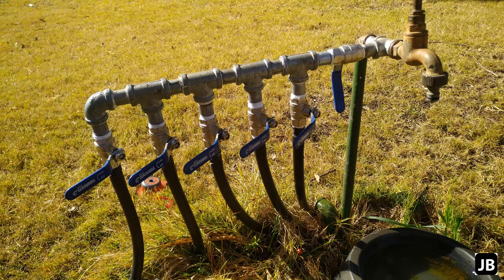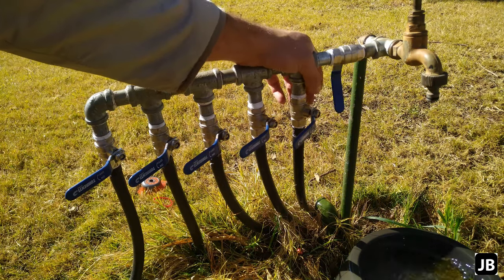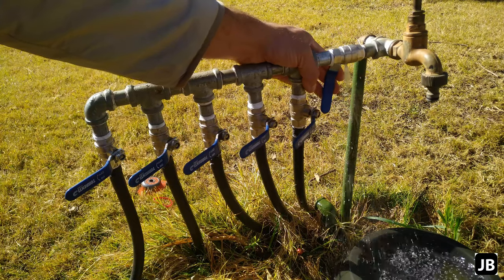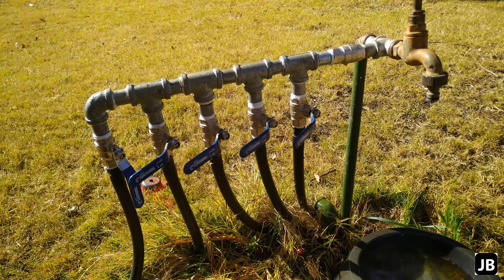Welcome back — it's the next day. Life unfortunately happened, but we're back now with everything put together. The only drawback to drilling a ball valve is that the moment you open it there's a little bit of water coming out. And if you want to throttle a ball valve, this is not going to work, because the moment you start throttling it keeps running. But other than that, either fully open or fully closed works like a charm — and my garden sprinkler is going!